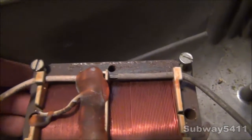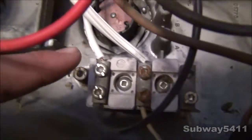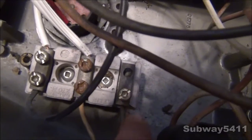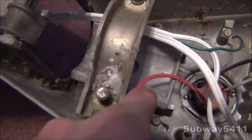But that doesn't matter — two screws are fine. We have these very nicely wound coils, and there are your inputs. The streetlight can take 120 or 240 volts. Here's a terminal block down here — this is your power in, this is your power out, and this is another block for 240 volts. This is a PCB-filled capacitor. It's very old, and there's no problems with it at all — this ballast works great. We have our leveler and our slip fitter, and we have the back of the photocell.